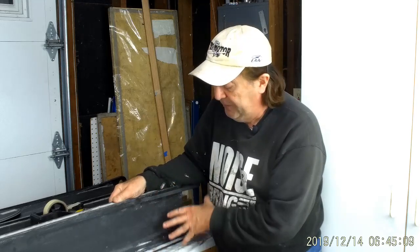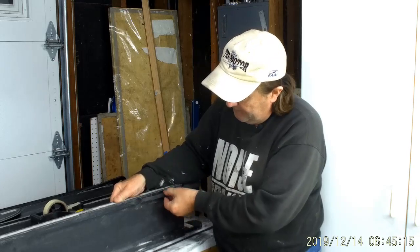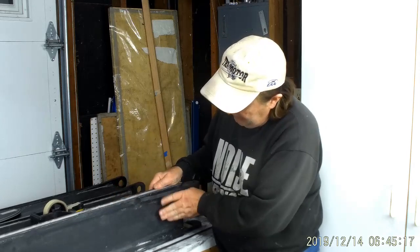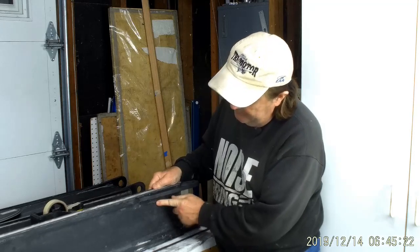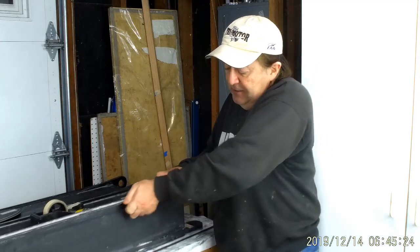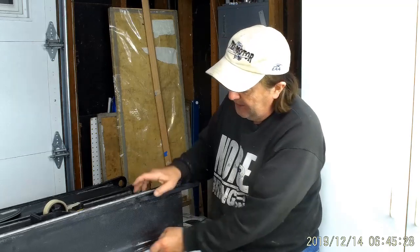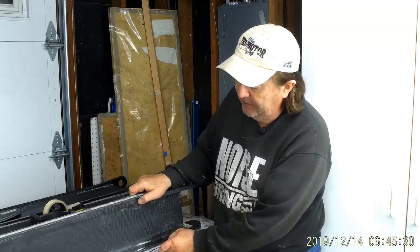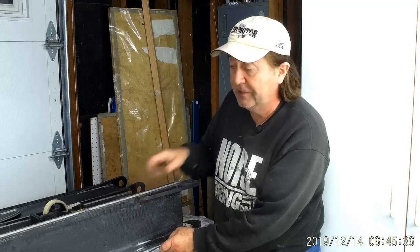So what you're going to see in the video here is I go through this whole process. You'll see a second phase at the end where I come back with an overwrap of carbon fiber. I'm actually going to wrap carbon fiber on the fitting. I'm going to go inside here, around the fitting, down, and then onto the shear web. So there's going to be like a channel on here that holds this strap tightly to the fitting and helps carry, it's a belt and suspenders. We'll essentially double the amount of lifting load that it can resist here.